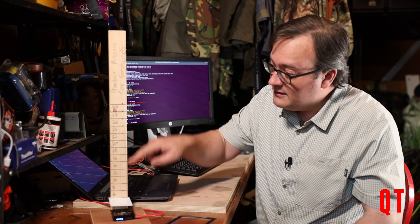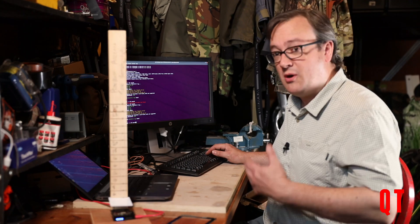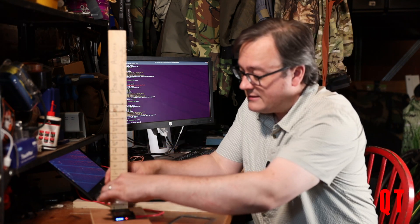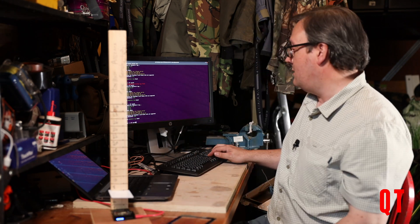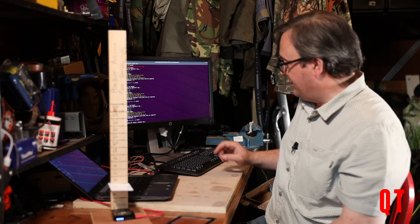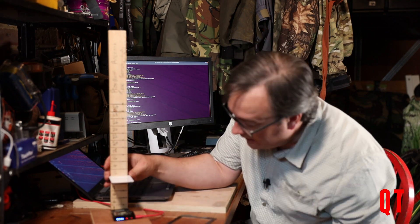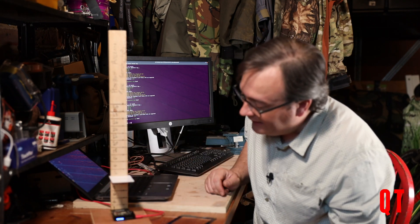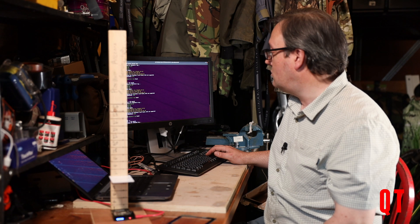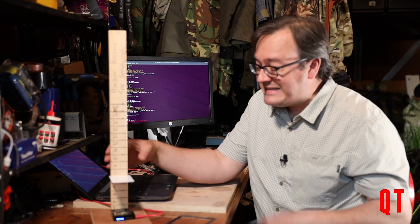Without further ado, I've got my card in the test rig and my Proxmark at the bottom. I'll run a bog-standard HF search without showing the screen — just to see if it can detect the tag. Yes, it can find that tag at that distance. Let's raise it up and put it back in the slot. HF search — it can find it there too. With the stock antenna we're getting a good reading at about eight centimetres. At eight centimetres range it can see it. Let's go up to 10 centimetres and see if it can read it there. Nope — can't see it at 10 centimetres. So that is the range of the stock antenna.